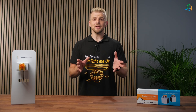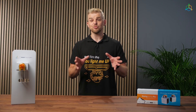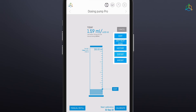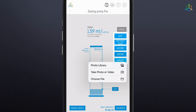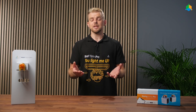"Skip Next Dose" enables you to skip or reduce the next scheduled dose. Enter a percentage value between 1 and 100 to reduce the dose — a value of 100 means skip the next dose entirely. If you do not want to use the skip next dose function, press the delete skip dose button in the dosing menu. "Export" allows you to export the configuration of your pump, including programmed doses, to a file so you can easily archive it in case you need to reset the device or hand it over to another user. "Import" allows you to import your pump's configuration, including programmed doses, from a file, so you can easily restore your pump settings after a reset or import settings from another user.